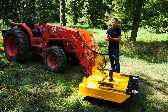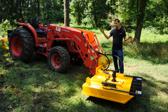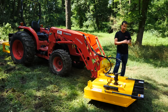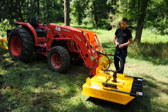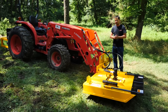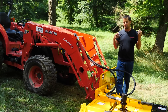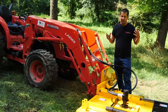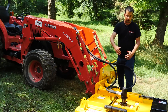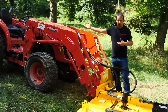The hydraulics on this are going to need between 9 and 14 gallons per minute. That's generally going to put you into the size of a Kubota standard L on up. In the New Holland line, you'd be into a Boomer 30, the mid-size frame, and up into their bigger compacts. It's not something for a subcompact or a really small tractor. To get enough hydraulic flow, you need that 30-horsepower-or-so tractor. If you take this 9 to 14 gallon per minute range, that's essentially between 12 and 17 engine horsepower — significant, more than enough to run a mower of this size, but not the amount of horsepower you'd generally have available on the PTO of a tractor to run the mower.